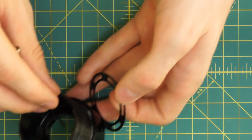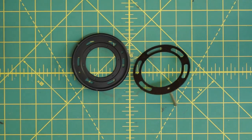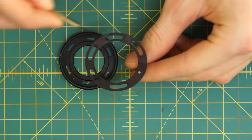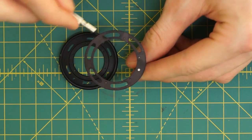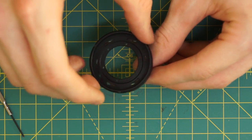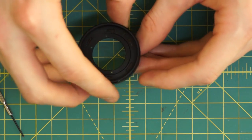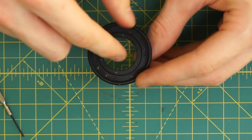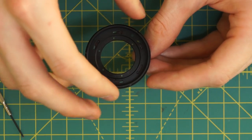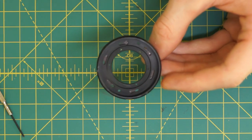I'm going to take the entire second plate out to make reassembly a little bit easier. I'll flip this over and carefully slide it out, taking the spring off just the one side with the post. Now I have these two pieces. Outside the lens you can see how they interlock - this piece has six little knobs going around and the other has little slots. The aperture blades have part of them on the inside and part on the outside in the other slot, so that when this rotates, the inside and outside of the blades move differently to open and close the aperture.